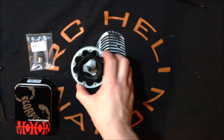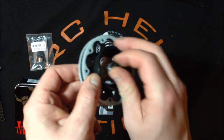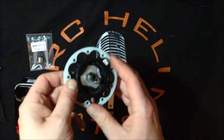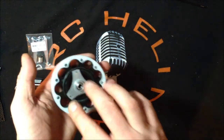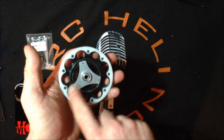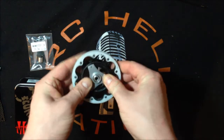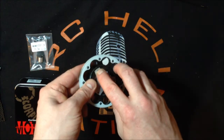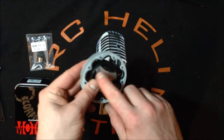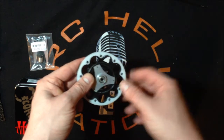Okay, and here is the end of step 27, all finished up. This part slides out, so make sure you don't end up dropping that and losing it. So this metal part, you've pushed in through the side where the grooves are. Make sure these line up. You might even want to push it in and snap it in a little bit. But either way, by the time you tighten these, make sure these are all the way through and that those ends are basically flush against each other.